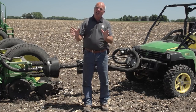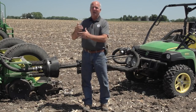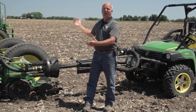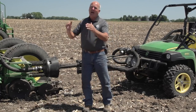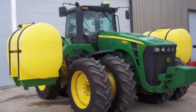A tank system that will carry 700 gallons, that will be balanced on the tractor versus hanging elliptical out front, or putting on, heaven forbid, 800 or more gallons in the center of the planter where we have a lot of pinch row effect. So we mounted tanks that are designed to stay within the shadow of the wheel footprint of the tractor. When I went out in the marketplace and looked at options and saw that there are a lot of tanks out there that hang outside the duals, over 16.5 feet wide, my stomach tightened.